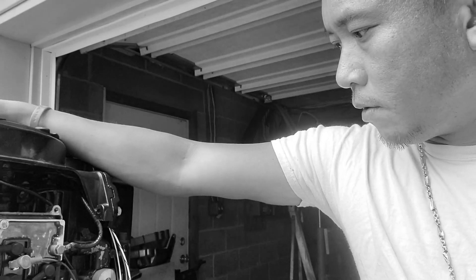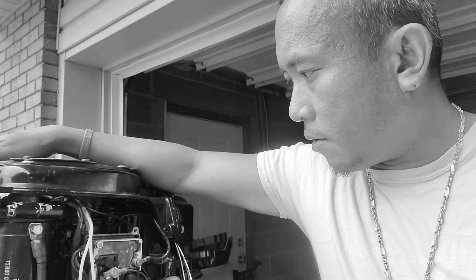In today's video we have a 1979-1980 850cc outboard — it says 80 horsepower on it but it's actually an 850. It has no distributor, ADI ignition. What we're going to do is find top dead center to make sure the timing is correct, and then adjust the carb cluster to make sure everything's synced — carbs and fuel all linked in sync. I'll put a link in the description on how to find top dead center.